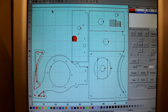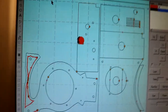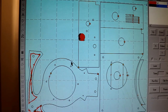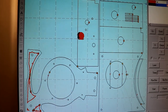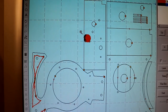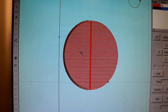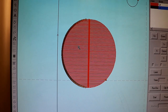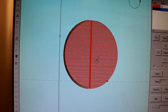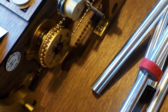This time I'm going to try and learn from my mistakes with the reed switches. I'm going to cut out just one, make it up, check it all works, refine it if necessary, and then hopefully not waste any time and material. These two red areas are going to be engraved at lower power. If you look at this circle, you can see it's made up of lots of lines 0.1 millimetres apart — that's for a little engraved sign that tells you how to reset it when it goes off each hour.